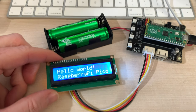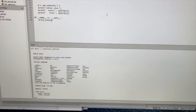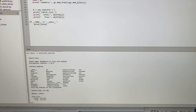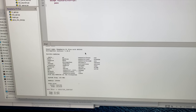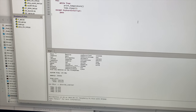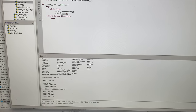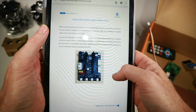Lesson nine uses the little LCD display connected via I2C — a couple more libraries to install, but it looks nice and bright. Lesson ten deals with getting information from the Pi: built-in modules, available storage space, and reading the internal temperature — about 20 degrees right now. At this point you'd think it'd say 'install all the code and build it,' but it doesn't — we build first and then go through more code before hitting the main stuff.